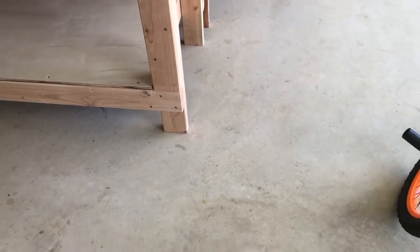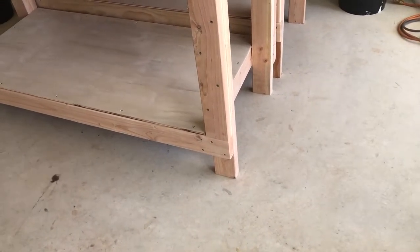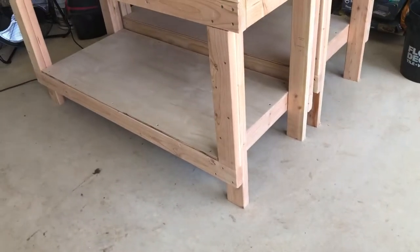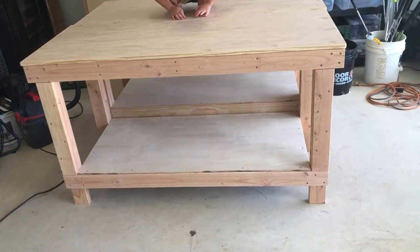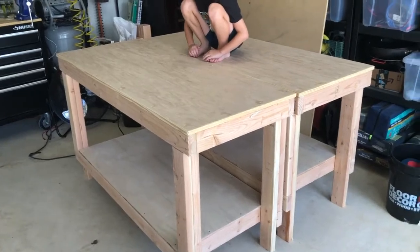On my second table I lowered it three inches — so instead of 17.5 inches I did 20.5 inches, and then the doublers would be 5.5 instead of 8.5. The reason I haven't put the doublers on the bottom yet is I'm going to go with some self-leveling legs. I found some on Amazon — eight for 30 bucks, they hold like 2,000 pounds. They're flat-mounted with an L on the bottom so they wrap underneath, with a polyurethane bottom so they slide a little easier. I didn't want casters because they seemed less stable.